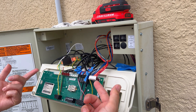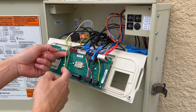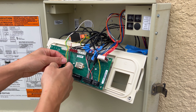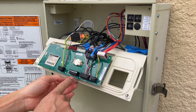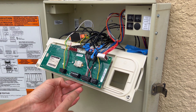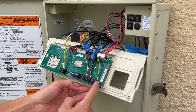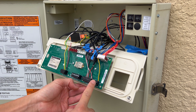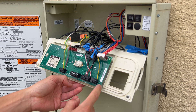You have to unbolt this board to see what's on the other side for diagnosis. The other inputs and outputs include RS-485 communications — I put a surge protector there after my last video — control to your pump, four wires going up to the wireless and ScreenLogic control, and the IS-4 remote input for a wired spa-side controller. Over here are three sensors: water, solar, and air, all of which I use. The last one is the heater output — a dry contact that closes when the heater is on — going to my MasterTemp 400 heater's fireman's switch.